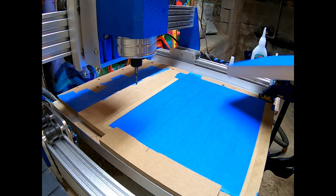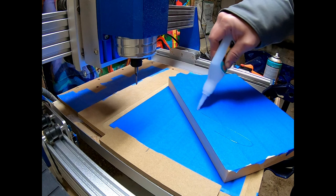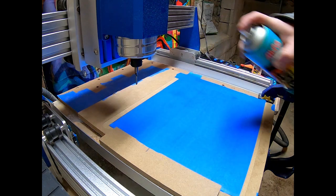I bought some 4/4 rough sawn pine, and I ran it through my planer and set it aside because I'm always working on something. So I found a piece that was about 9.5 inches wide. I ripped it to 9 inches even and cut it to 12 inches long.